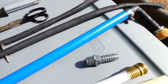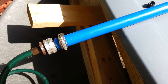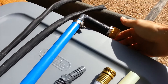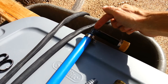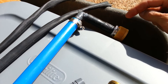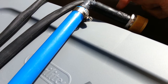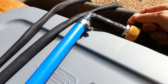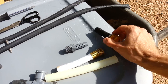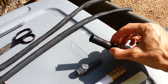This is good for solar projects that aren't under pressure. I wouldn't do this on your house or on a well system where the well is going to keep pumping if this comes undone, but it seems very stable. I'll take the connection off just to prove it's under pressure — this is going to come off here probably before I can twist this end cap off. I also put an inner tube here to go into this drip irrigation line. So there you go — that was under pressure and the only piece that came off was the drip irrigation line, not the piece with the hose connector and the PEX.